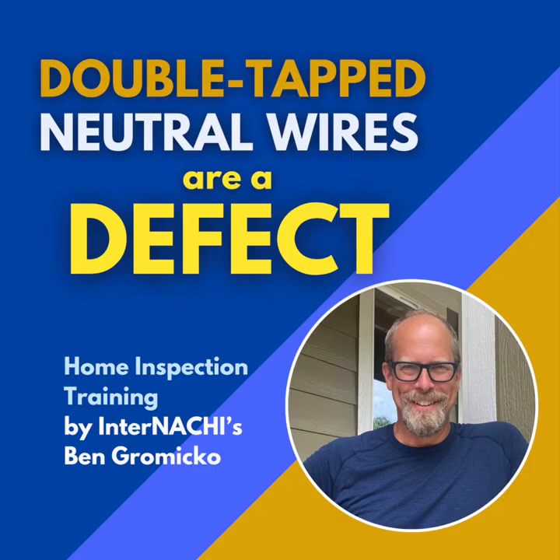There's also MWBCs — multi-wire branch circuits — where the danger gets amplified. An MWBC is basically a permitted wiring shortcut that uses two different hot wires sharing a single neutral wire to power two separate 120-volt circuits, often found in kitchens. If that shared neutral connection — which might be double tapped with another neutral at the panel — becomes loose or disconnected even for a moment, the voltage balance between those two circuits goes completely haywire.